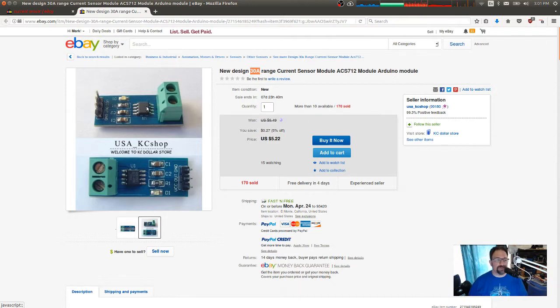So what I really want is to have a 3-port module. Here, let me go back to the view of me. What I want is a 3-port module with an input and a current sense on that input, a battery with a current sense on the battery, and then an output with a current sense on the output. And then since all 3 of those are tied together, just have a voltage sense from that voltage to the ground. And so that's 4 analog voltages that I'm looking at: 1 for each of the 3 current sensors, and then 1 for the voltage sense.